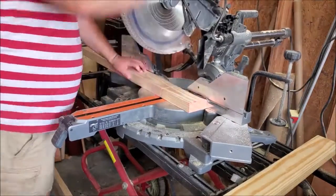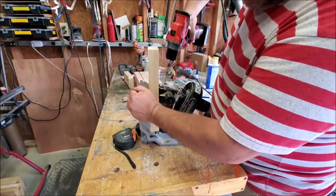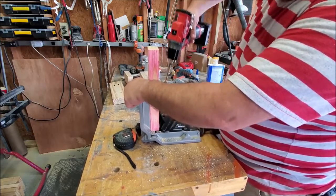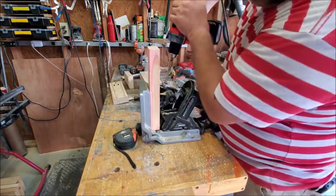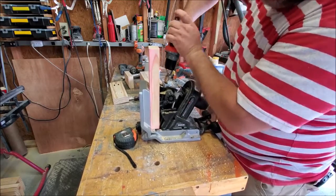Now we're going to cut the legs at 31.5 inches long. We're going to put pocket holes in all 4 of the boards. Now, I usually pick the ugliest side to put my screws in, and that way they won't be seen.